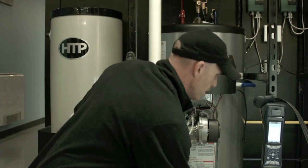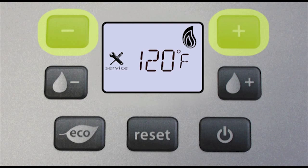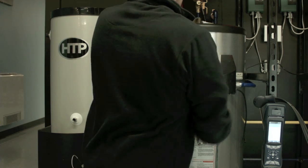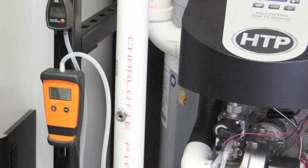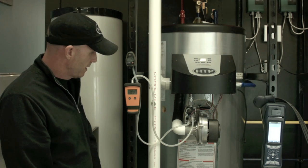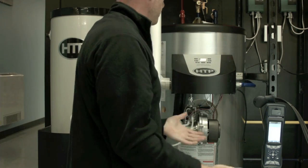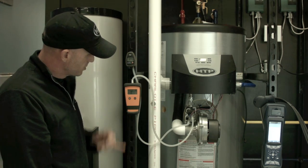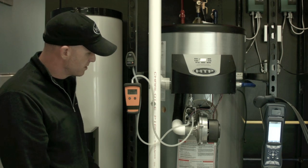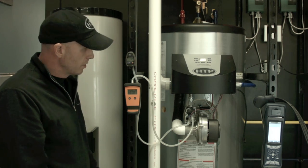I'm going to put it in service mode. To access service mode, you hit the minus and the plus arrow together at the same time for about 5 or 6 seconds, and it should put you into the ignition speed. There's our ignition. There's our drop — we have 7.2, 7.1, so we're dropping a little bit above the half-inch, but you're going to be okay there. I'm going to press the reset button — that's going to take it out of test mode. I'm going to check my manometer and make sure the lockup pressure is still within range. It comes back to 7.7, 7.8, which is what we run here in our training center — we're good with that.